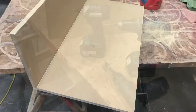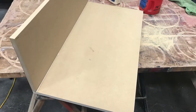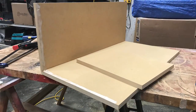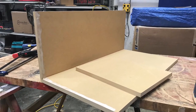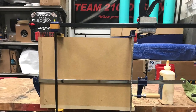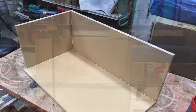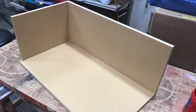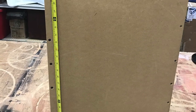Counter sunk flush. This box will be wrapped. I really don't use silicone. I used to a long time ago on my insides, but when I started really honing in on my cuts, making sure everything was flush and even and crisp, gaps went away and the glue kind of did everything for me. I always run a bead on the inside — that's what you see there on the corners. That's just a bead of glue run with my finger.